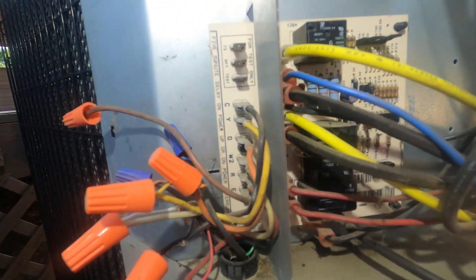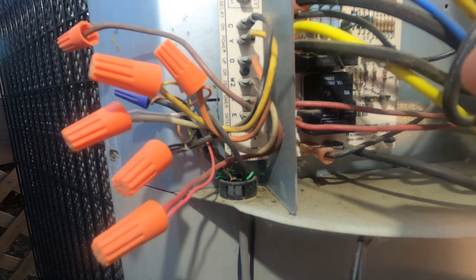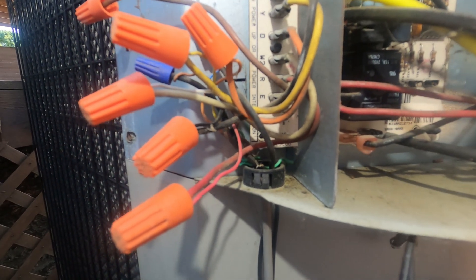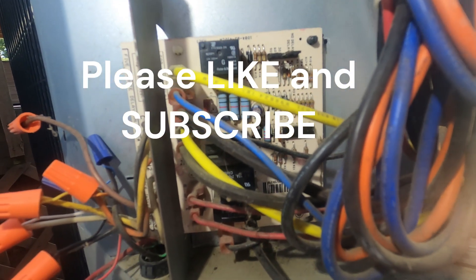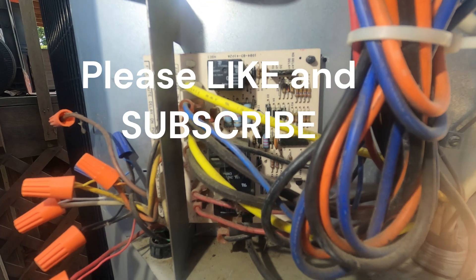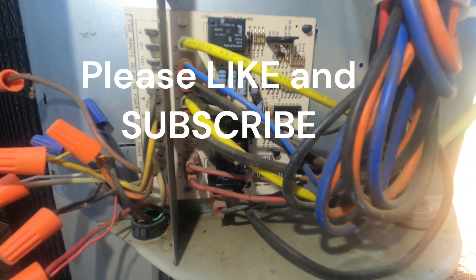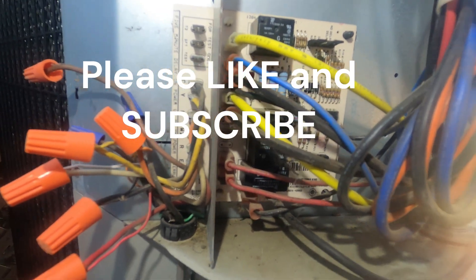That's just a quick video explaining how defrost controls work. You're going to have a wire that sends 24 volts back into your heat strips to turn those on while it's in defrost to cancel that cold air. Obviously you've got your reversing valve energizing and de-energizing, but the board controls that in the defrost cycle — not the thermostat. Basic operations on how defrost controls work on most common heat pumps: if you don't have a switch, you're going to have a demand-based system and you're going to be looking for an ambient temperature sensor and a coil temperature sensor.